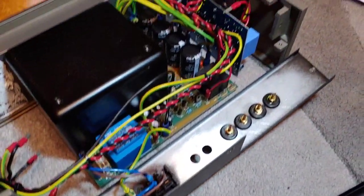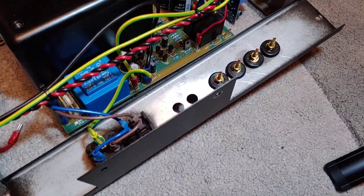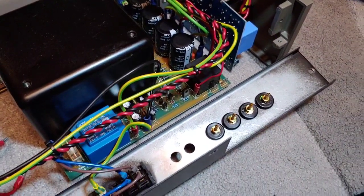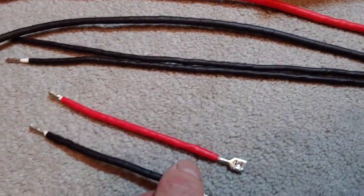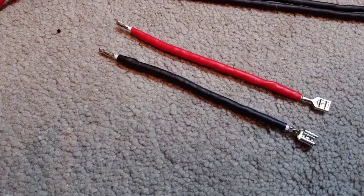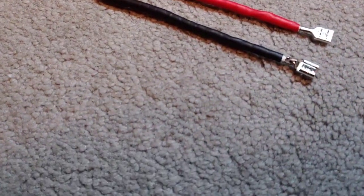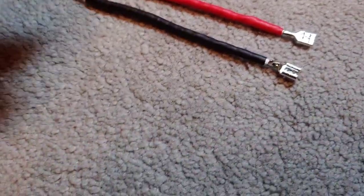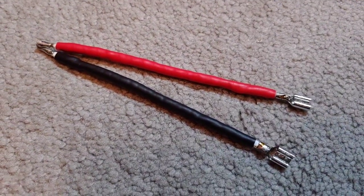What I'm doing is rewiring the whole insides. I've already started making up some of the wires — these are all various strand, made from 10-strand silver-clad copper. I'm putting new spade connectors on, soldering all the wires in, and then crimping. I don't really like crimping so soldering is better.